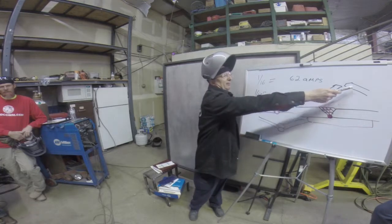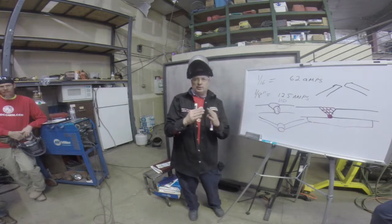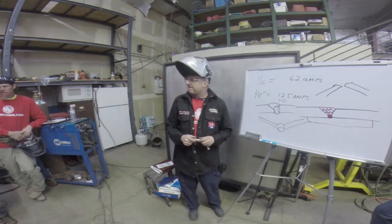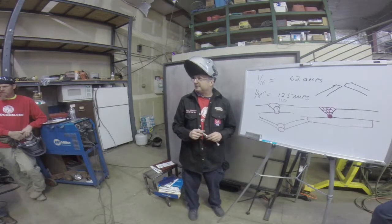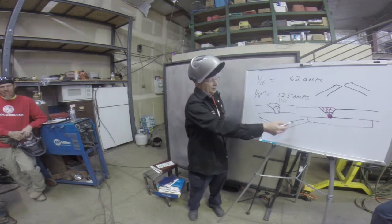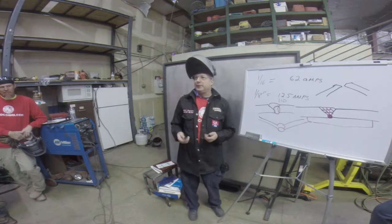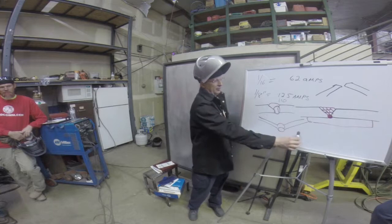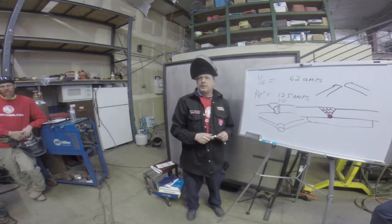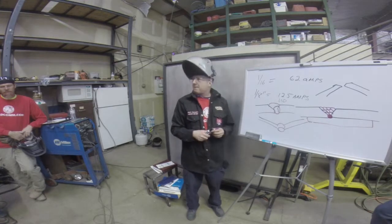And this is more of an art than a science. It takes years of experience to know how much to preset that. Some guys do handrails like that. They're totally out of whack, and by the time they're done, it's perfectly square. It's an art. If you do have a weld and you end up like that, and it's carbon steel, you can take an oxyacetylene torch, again back to being an art, because you've got to know where to put it. But you can heat this side up here, and that plate will pull back down some. So there are ways to undistort things a little bit. There are limitations. Better to do it right in the beginning, though.